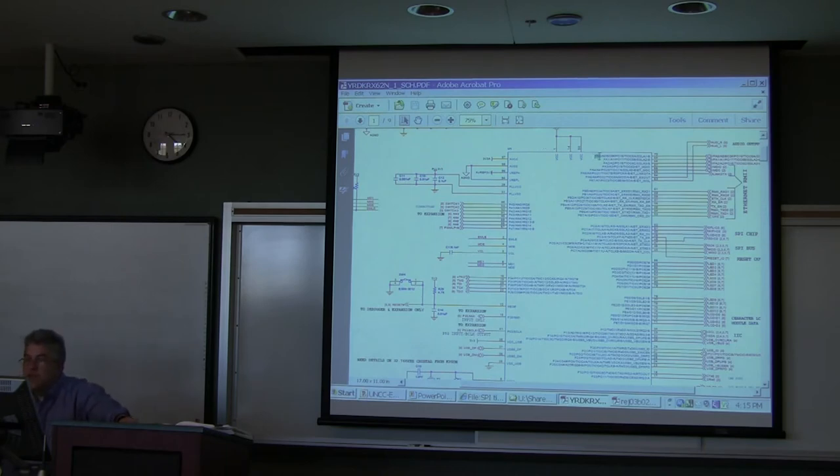Here's port A, right? But it also says A0. And if you look carefully, A0 through A7, A15, 16, 17, 18, 19, 20, 21, 22, 23. What do you think that stands for? Address. All right, address. Remember earlier I talked about how with this chip you can have on-chip RAM and ROM, or you can go off-chip to your RAM and ROM. And to access memory off the chip, you actually need address lines. So here you go. These would be address lines A0 through A23.